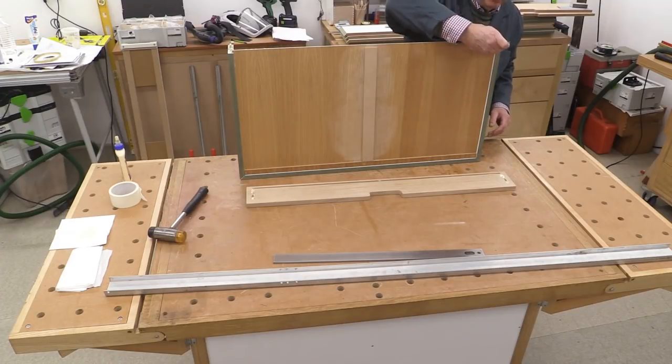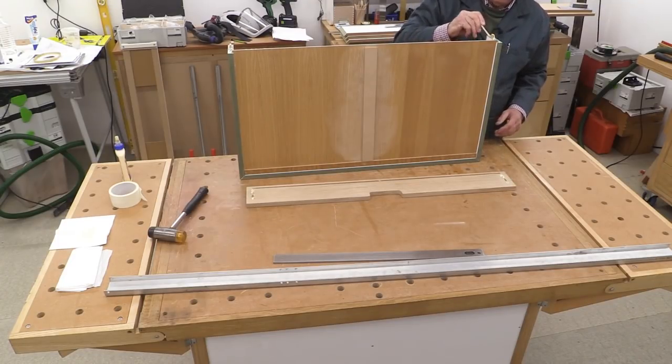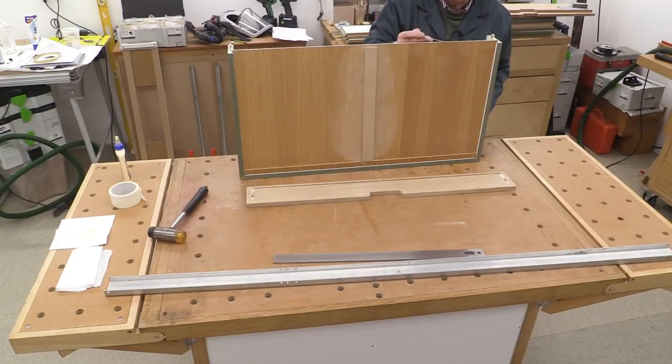Now we're going to introduce the base. It really does help to try and get the base even from left to right. So once it's even, all we do is lift up here and almost magically that masking tape is keeping that joint nice and tidy. We've brought that up together. I'm just going to put some glue on the end of the MDF up here. It's very important when you do a glue-up like this to try and get the right amount of glue — just enough to do the job and not so much that it all oozes out.